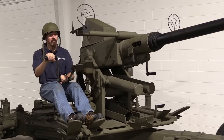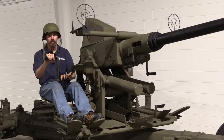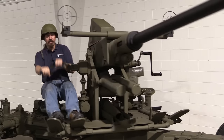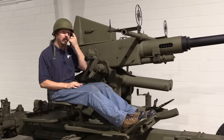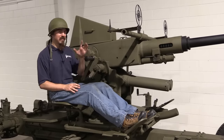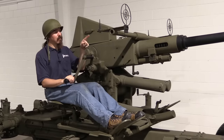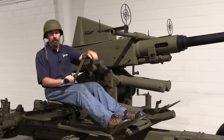This thing has a pretty fast rate of traverse. On the M2A1 carriage — which is what we have here, updated as aircraft got faster and faster — every full rotation of the handles gives 17 and a seventh degrees of rotation of the whole gun. The previous M2 basic version of the carriage did six degrees per revolution, so they almost tripled the rate of rotation. This thing can do a full 360 degrees, and it can go from pointing straight up at 90 degrees to negative six degrees downward angle.